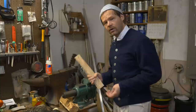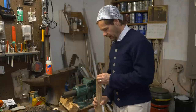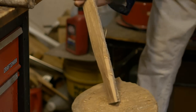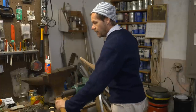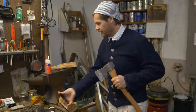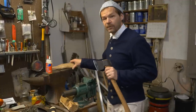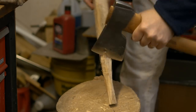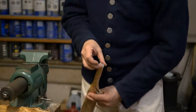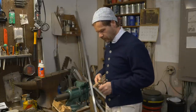As the glue on the antler knife sets, I'm going to work on this other knife using a little more traditional techniques. I've got a piece of nice stout hickory here, and I'm going to chop it down into the rough diameter of our bolster. You can use one of our tomahawks, but the carpenter's axe that we sell on our website and in the catalog is really the perfect tool for this kind of job — it's got a little bit more weight to it, it's beveled just for this kind of wood, and it's super sharp. When you're using it, you hold it up nice and tight up to the handle so you've got a lot more control. I've gotten it down most of the way with the axe, and there's still a little bit more carving to do. Once I get down to a smaller size, I'm going to use my little carving knife to smooth this off and get it down to its final shape.